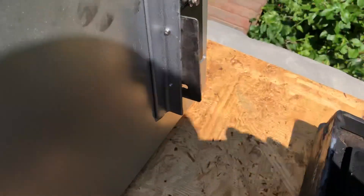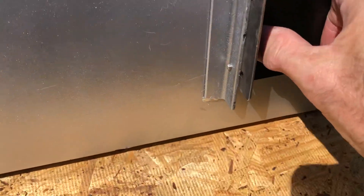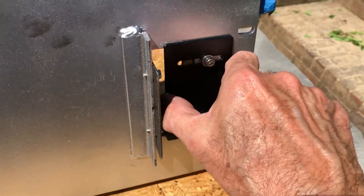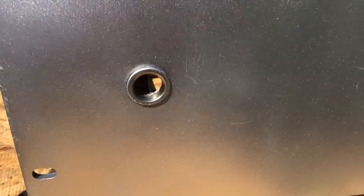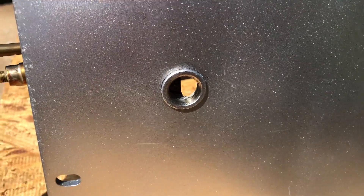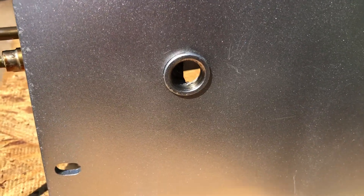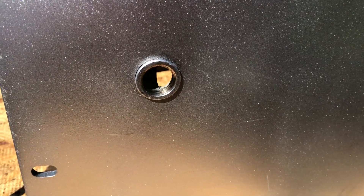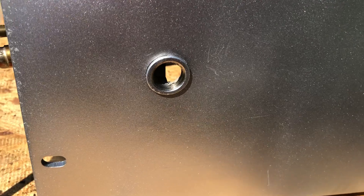Also, on the bottom there's an adjustable door — we can open and close it and put it where we need to. In addition, this hole right here is a modified three-eighths inch stainless pipe cap, and it can be used for an oil pilot burner, similar to what Bob Ockenbaugh did on his.